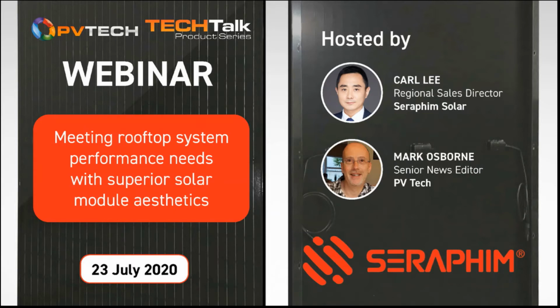It is common that a full black module price is a bit higher than the regular one. The reason is mainly because of the black frame and black backsheet that we are using. The material cost is higher, and also if you want to get a higher output for the full black module, you have to go with a higher cell efficiency.